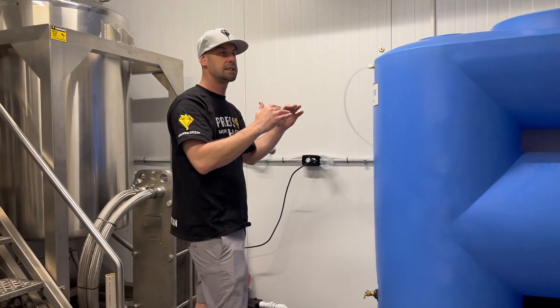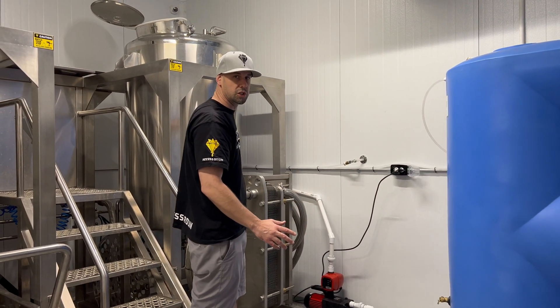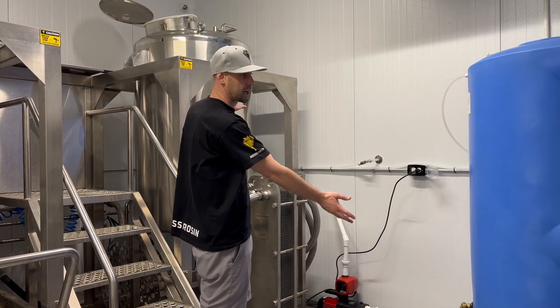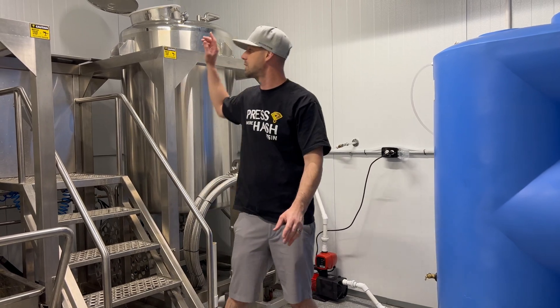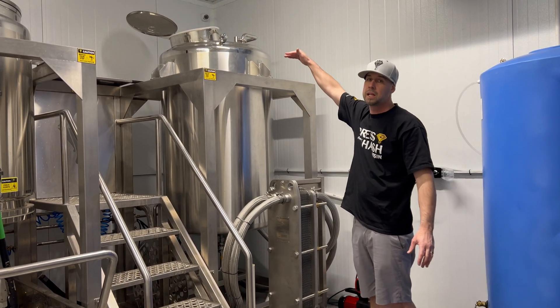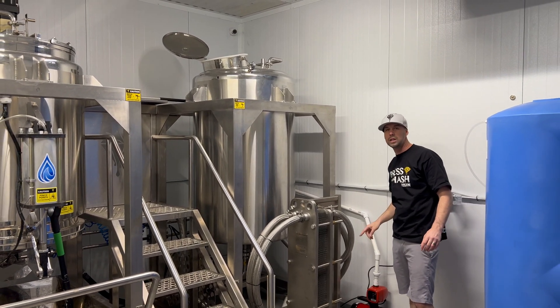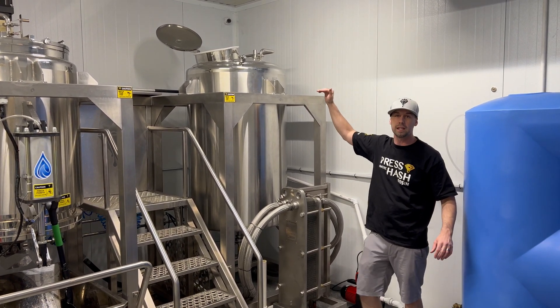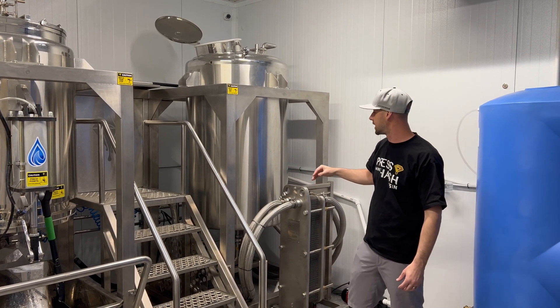So it's going from 70 to 50 to 55 degrees. Then once our chilled tank needs water, it will transfer water with the hydronic pump, which has a pressure switch. We're going to transfer it into our 185-gallon tank, topping it off very quickly. That's why we upgraded to the one-inch pipe — so it fills up very quickly and everything can transfer and start to recool very quickly again.